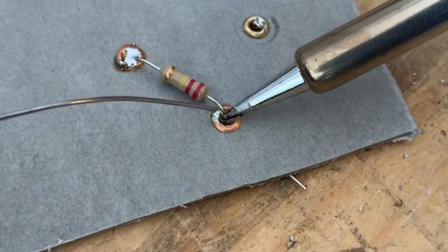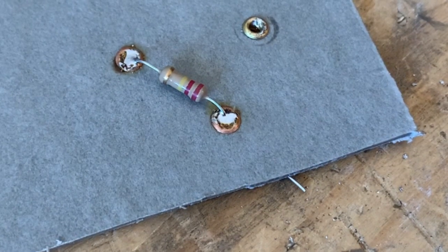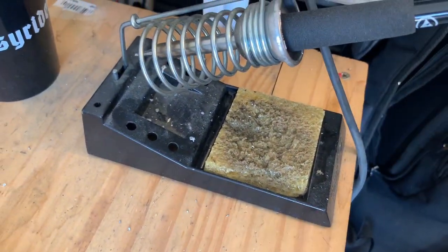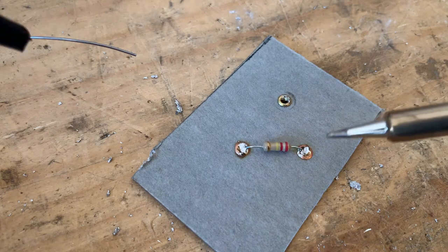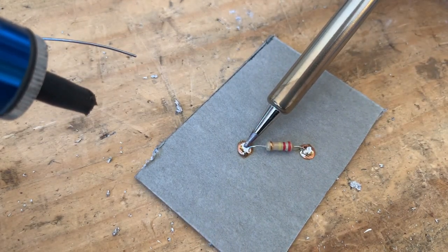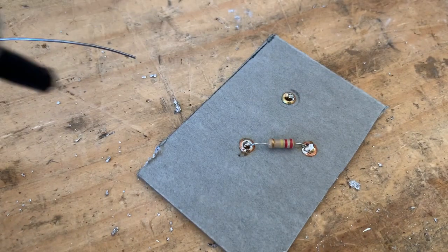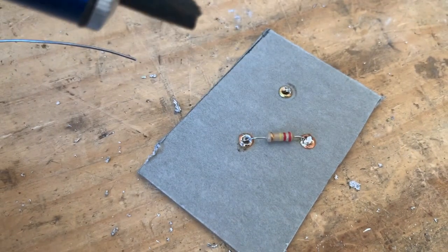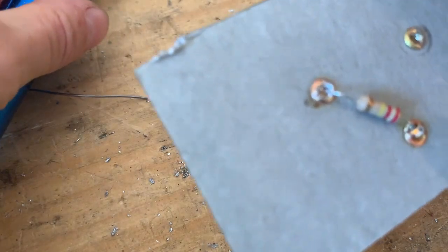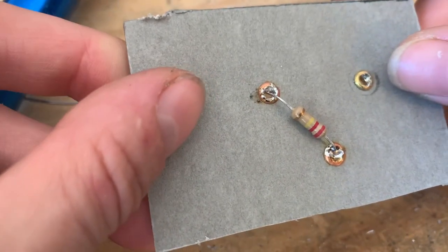This could use a little bit more. It's got that nice glossy shine. And once you're done soldering, it's always a good idea to clean off the iron. Now I'll show you how to desolder — you'll do this if you're changing a component. You heat up the solder joint and then take the solder sucker and just suck it right out. You can see that most of the solder has been sucked out, and you just keep doing that until you're able to free the component.